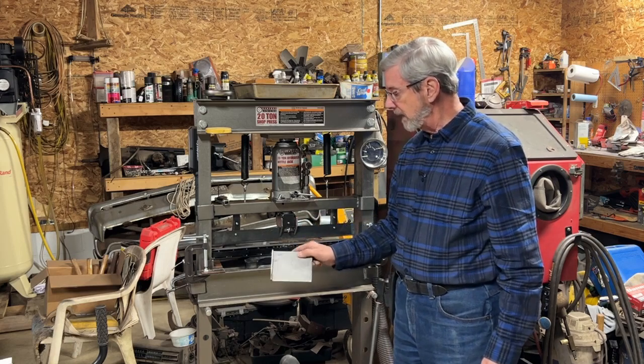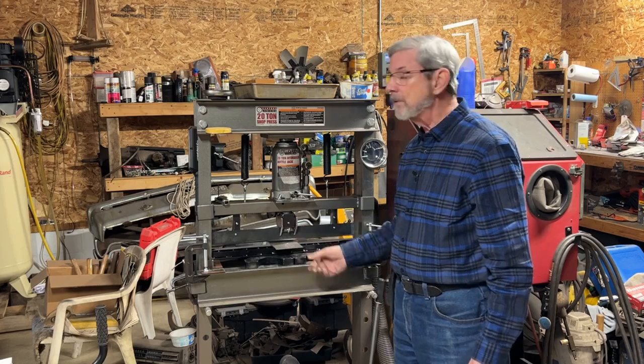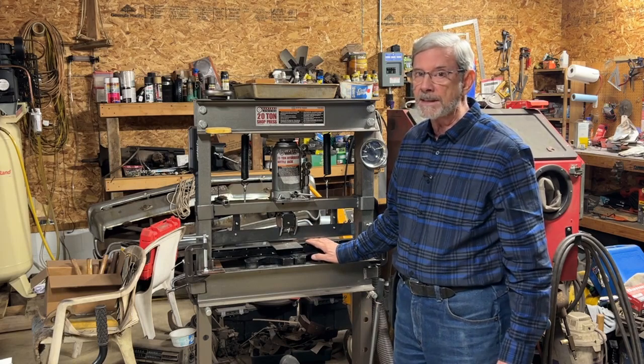And then I decided to go ahead and try some 1/8 inch steel. That's 4 inches wide, and I bent that up to 90 degrees. It worked out well. So this is even better than I thought. And would I go back to the 1/2 inch angle iron? Probably not. I'm going to stick with the 3/4. I think that's a lot safer.